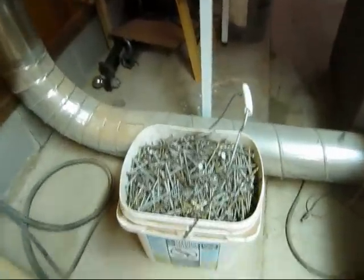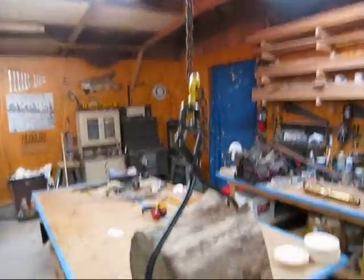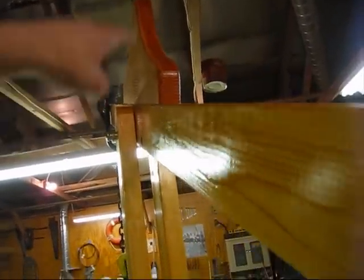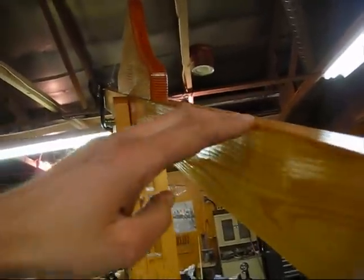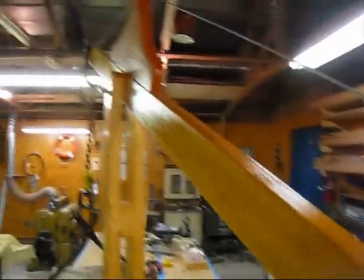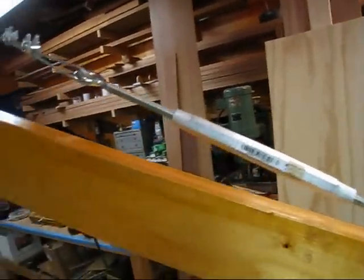I tested it: there's a bucket of screws here that weighs 65 pounds and another bucket weighing 75 pounds full of screws, so that's 140 pounds plus 20 pounds of rigging — 160 total. That wasn't quite as much as the 180 I had before with the log and rigging, but I lifted that in the shop about 15 minutes ago. I looked at this lever arm and with the tension on it I had a little reverse curve, and when I lifted that load up, this was straight — no bow at all. I'm real happy with how this fix came out. And if the cable sinks into the wood over time, I've got plenty of adjustment room on this turnbuckle to keep adding a little tension.